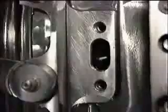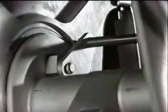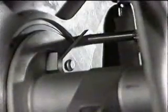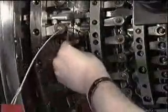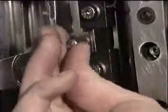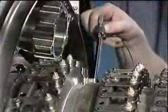Before the supports can be fitted, the variable stator vanes must be moved to the low speed condition and then rig pinned to prevent possible movement. This will ensure sufficient clearance behind the stage 3 stator vanes to allow the supports to be inserted. Fit the support with the blade side towards the rear of the engine. Insert through the access hole. Tighten up the 2 bolts and turn the adjusting thumb screw until the blade contacts the shaft, tightening to finger tight only. The fitting procedure is the same for all 3 support rods.